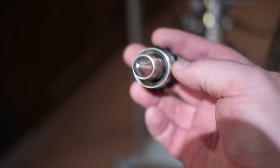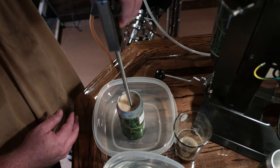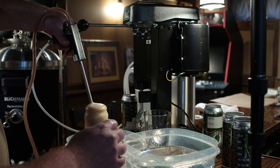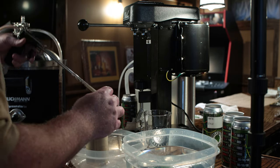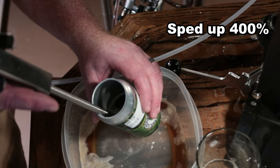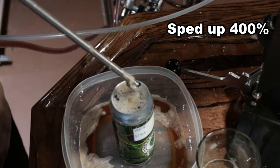One of the things that made the process easier, in my opinion, is the aseptic valve on the G4 has a linear flow valve, which basically allows liquid to flow kind of undisturbed. The first couple of cans, I had a lot of foam — I probably wasted about three or four cans trying to get it right. There wasn't really enough flow and it was foaming a little bit, but as I opened the valve a little bit more each time, trying to figure out the good flow rate with low foam, I finally got it.